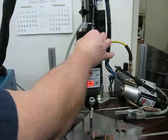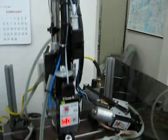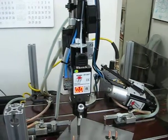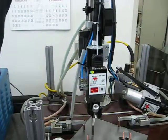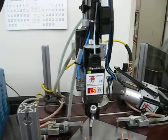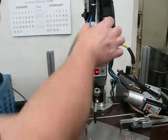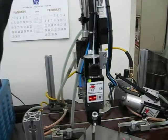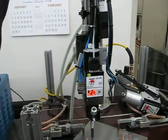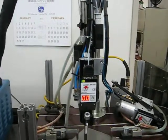I'm going to make it where it lifts 2 millimeters. I just turn this counterclockwise three clicks. Go ahead and release, and push it again. 1.9 — so the lift is 1.9. Release, one more click. Each click is a tenth of a millimeter. Push it again. Now it's lifting 2 millimeters off the surface. That's how we set the lift on this weld head.